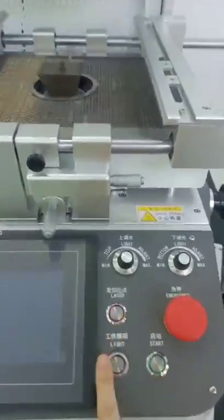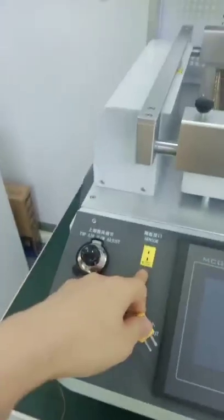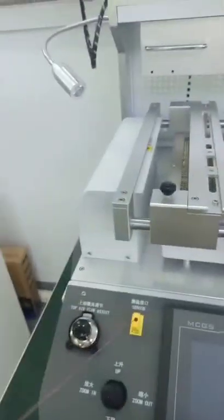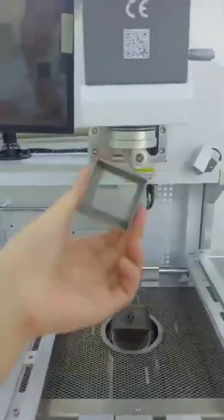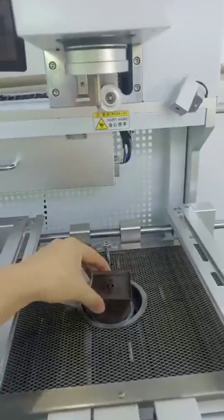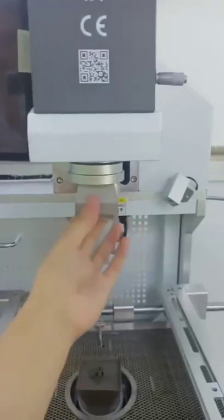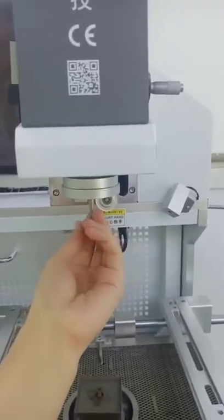And this is the red laser dot button. This is the light button for these two lights. This is the start button, and this one is the emergency button. Here is the sensor. This is the thermocouple wire — it is to monitor the temperature of the PCB board. Here is the top air nozzle, and this one is the bottom air nozzle. They are connected by magnetic force and can be rotated 360 degrees. Inside is the suction nozzle, which is used to suck up the chips.